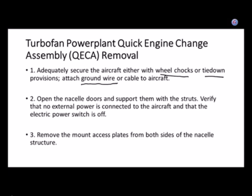But let's say you didn't do it. Think about the rubber tires. Rubber is a pretty good insulator of electricity. So you could have blowing dust blowing across the airframe and cause static charge to build up on the airplane. You could walk up to the airplane, and just as you go to touch it, that static electricity trying to get to the ground could go through that last inch of air, and it would hurt. More importantly, if there was some jet fuel that had just evaporated right there, it might catch the jet fuel on fire, which is one reason why you generally ground an aircraft while you're refueling it. So that's the second one.